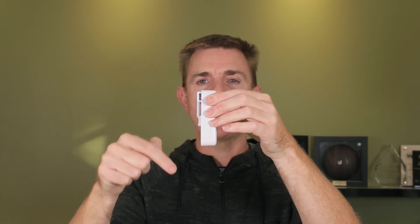Let's not just have the cable out of the wall, or worse, cable straight down. If we're coming out, make sure that we come out, down, and back in — out, down, and back in. Why? Moisture that's hitting this, or coming down from your external access point, is going to travel down that wire. If we loop it first it's going to drip off at the bottom and it's not going to seep up into the joints. In the worst case, we've actually seen Ethernet cables absorb water and after a period of time it has traveled all the way — up to 30-40 meters down your Ethernet cable — and into your switch or wherever you've put it inside. So let's get that drip loop in.